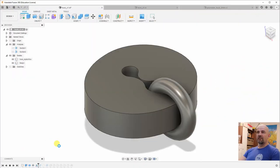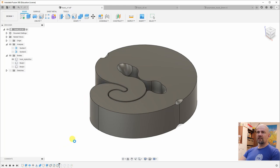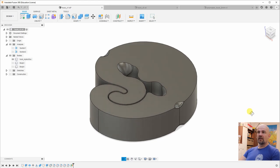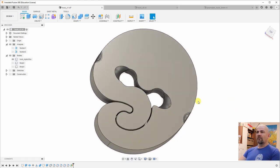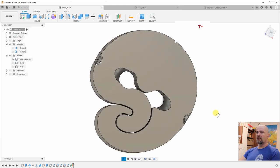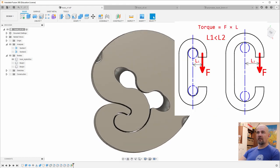These are the design steps of my first version. I decided to go with a locking mechanism because according to the rules the hook must be open, but in this version, when it starts bending, the mechanism will actually hold it together. This idea was later used by several other YouTubers. I also went with the smallest hole possible because torque equals force multiplied by arm length — if the arm is smaller, the torque is smaller — so I tried to get as close as possible to the center of the hole.